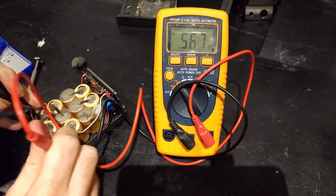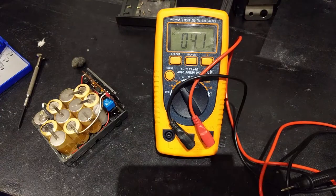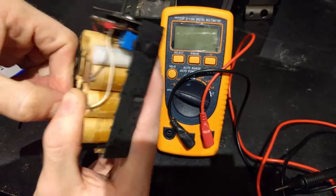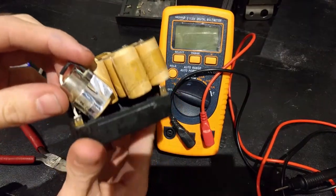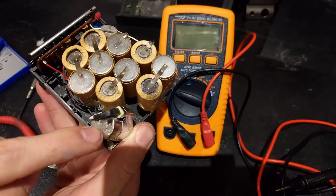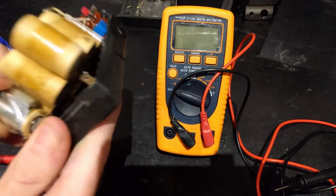Just for fun, let's see what the battery pack reads. We get a full 0.9 volts from 11 cells — not really a champion effort there. But look at this — it actually looks like it's got a thermocouple in the pack. In something this old they actually had temperature protection in the pack. It looks like they've left the cardboard case off one of the cells so they can bond a thermocouple right to it. And they've done this properly — they've got spot welding putting the tabs on the batteries. That's how you put a proper pack together: nice low resistance, very sturdy, much better than soldering.